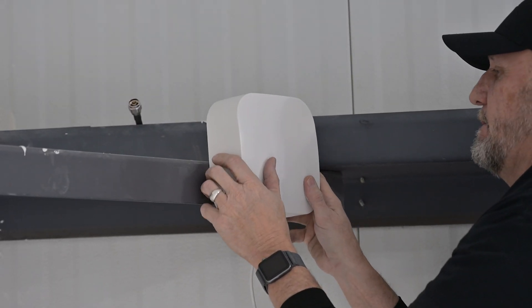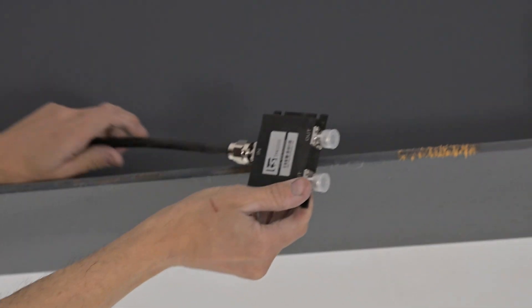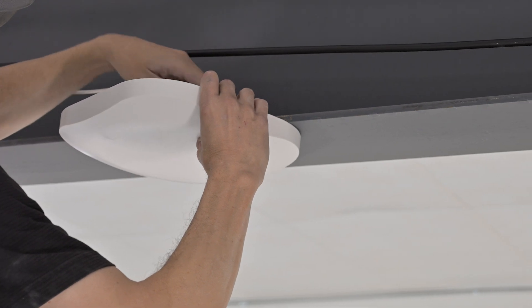Installing a wall-mounted panel antenna often requires drilling holes and pulling a coax cable from the amplifier through your home's walls. Mount the panel antenna on the inside of an exterior wall with its front face pointed in the direction where you need signal inside the house. For maximum signal coverage, try installing the antenna in the corner of a house at a 45-degree angle from the walls. Be certain the panel antenna isn't pointed toward the outside donor antenna. If your booster system includes two or more inside antennas, attach a short jumper cable to the amplifier's inside port, connect the splitter to the jumper cable, and then run one coax cable to each inside antenna. Inside broadcast antennas can overlap in their signal patterns without causing oscillation.